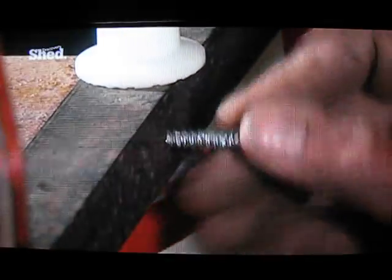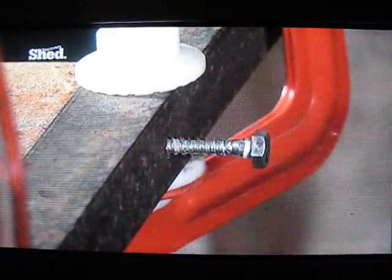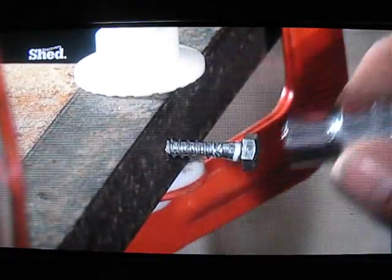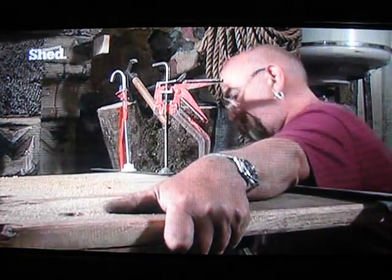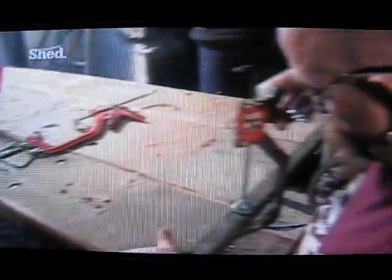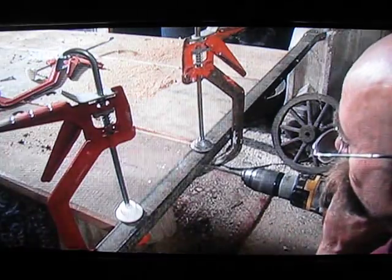Normally, I'd use a pilot before fixing a large screw, but because it's the end grain of decent timber, I'm confident it'll be okay. Not sure I'd say the same for new timber. This is tough but meticulous work as I move around the table. Eventually I'll have used 12 chunky coach screws and my top will be rock solid.